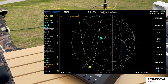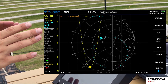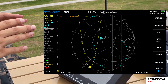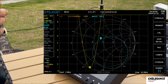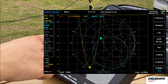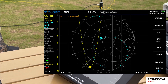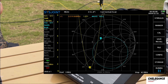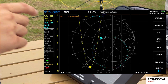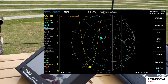You might find different results in a different location — different radials, ground conditions, or surroundings — but it won't be a very big issue. Just tune accordingly based on what you find. From our reading of 3.5 MHz, if we want to go higher — say 3.6 or 3.7 MHz — we shorten the telescopic whip and come back to check the readings again.